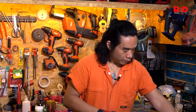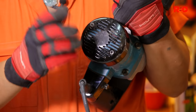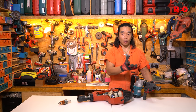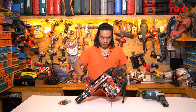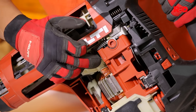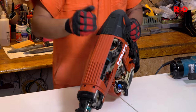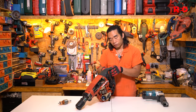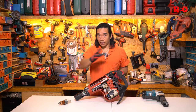ourselves. For Makita, just now you can see, because the opening is here, the dust comes in and blows everywhere, like a hurricane. And for TE800 AVR, it's very smart because the fan is here, but the opening is actually here. So once you turn on, once you put your hand on it, you cannot have direct contact with the opening. That will prevent dust flying everywhere.